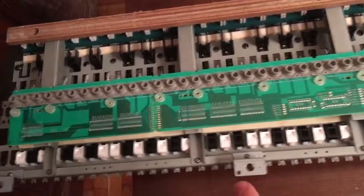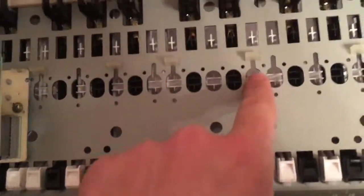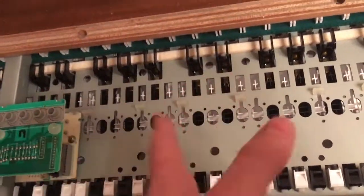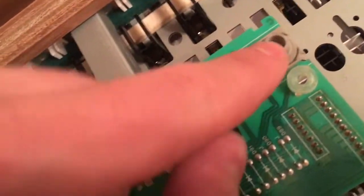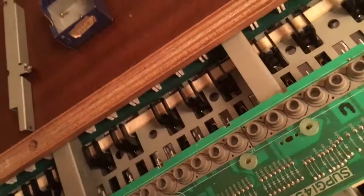On this particular board, you also have these holes I mentioned before, which actually make things worse for reassembling, because what usually happens is that the end part of the contacts gets crumpled by the border, and then the key doesn't work. So one needs to be very careful in reassembling it. On other keyboards, you don't have this, so it's not really a problem.